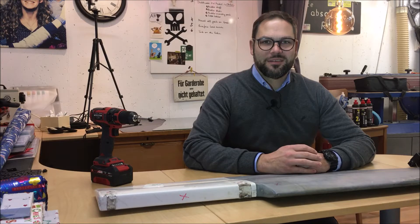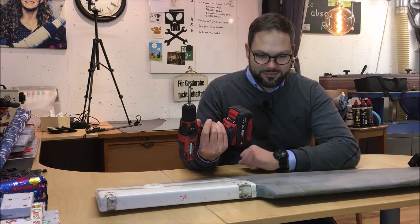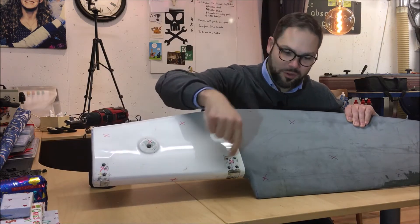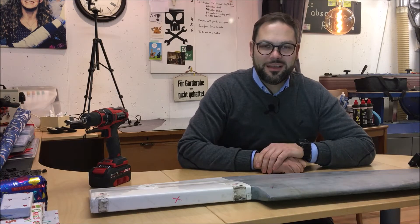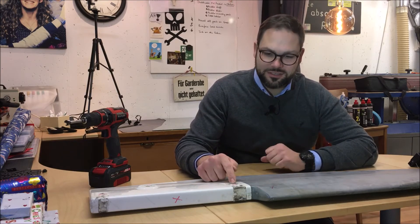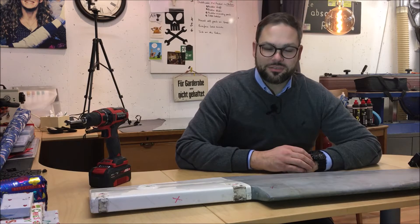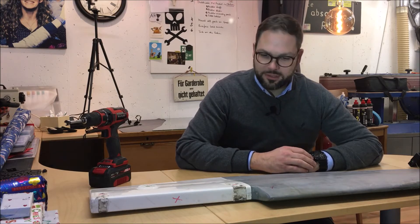Here is my plan to produce these rudder plates. Step number one: I will drill different holes in the existing rudder plates. Everywhere I have marked with a red cross, I'm going to drill a hole. This is important because by doing so I will see exactly how thick the glass fiber layer is in the original rudder plate, which will tell me how many layers of carbon fiber I need to put in the mold.